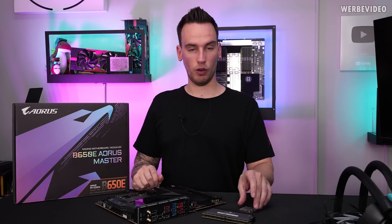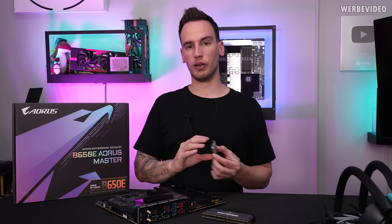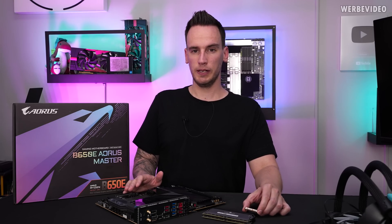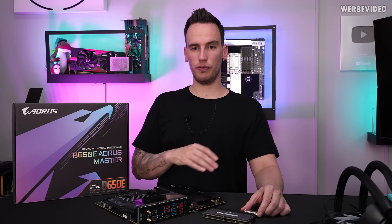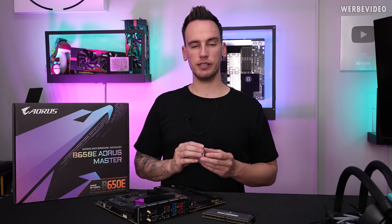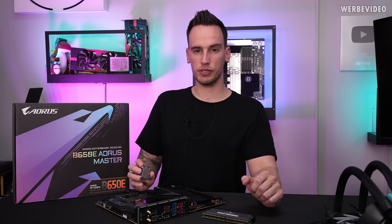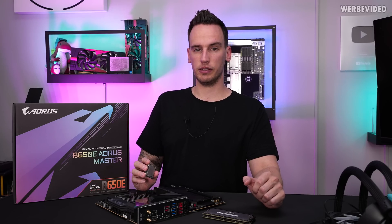That's what we're going to do in today's video. We will overclock the 7950X to test how the VRM on this board holds up overclocking the AMD 16-core CPU. At the same time we also want to test offset mounting — something we did with AMD Ryzen 3000 CPUs, since starting from that generation AMD did not have the hotspot in the center of the CPU. Igor's Lab already confirmed there is a hotspot sitting a bit more in the south of the CPU on Ryzen 7000 as well.